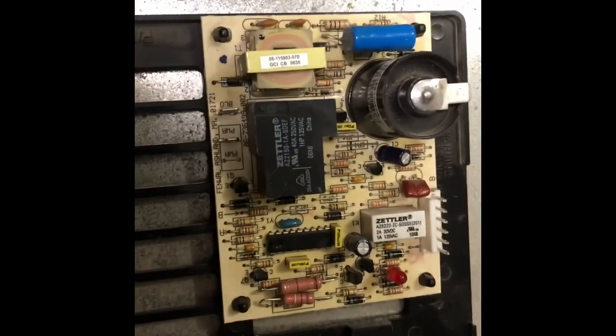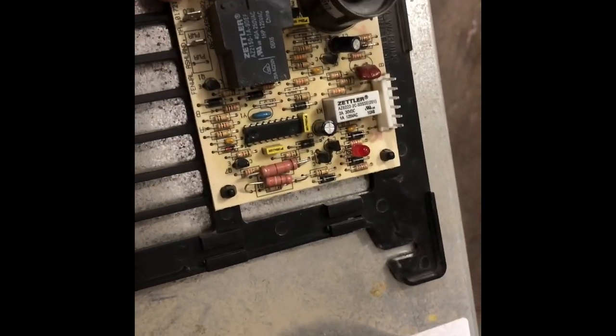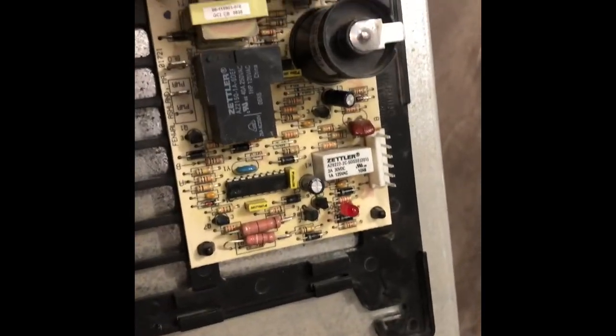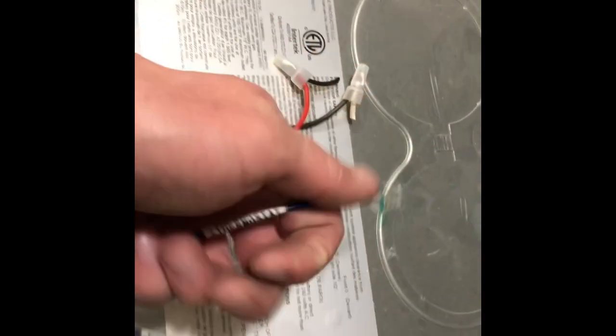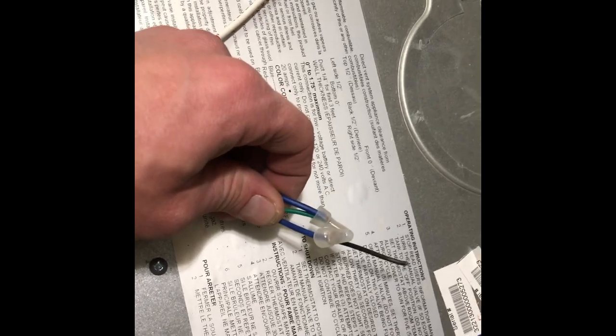The next thing you would check for is you would get your voltmeter, and you would turn your thermostat on, or twist your thermostat wires together. As we have thermostat wires here, you would take these two blue wires and strip the ends. This is if you're bench testing. You would twist these together, and that would create the signal, the continuity, to fire up.